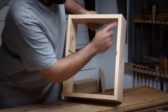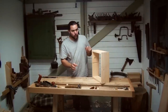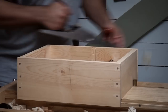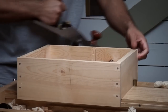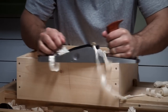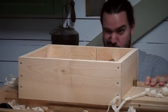However the front is another story — every joint is stepped, and it may even be slightly twisted. It does have a little bit of a twist in it. So what we're going to do before we plant our face frame on this is flush off all of these joints and get any of that twist out. We knock off all the high corners first to roughly level things out. Once it's looking something like, I plane right around the carcass until I get a continuous shaving, then check for twist just by eye.